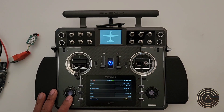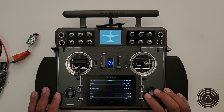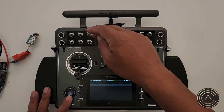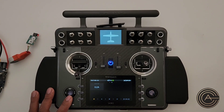Now if I trigger the switch it tells you how many amps at that exact time. Same thing here — if I wanted real-time that's fine, but I think I want it to tell me the maximum value. So hit and hold down on that value and choose Max. Return to get out of it. There we go — we've got our current display showing maximum, and a switch that announces the maximum current.